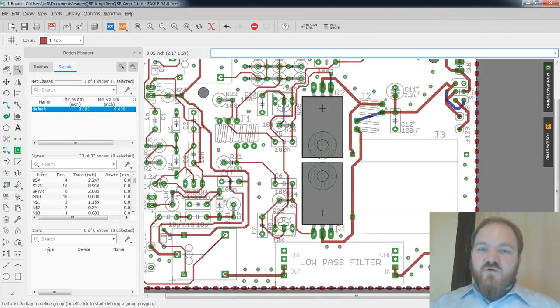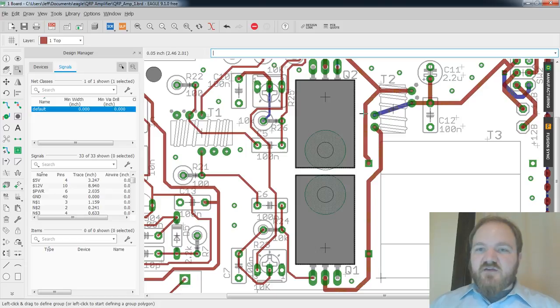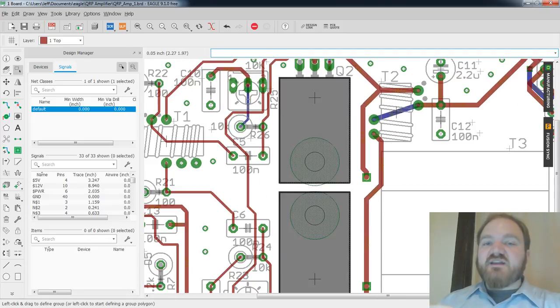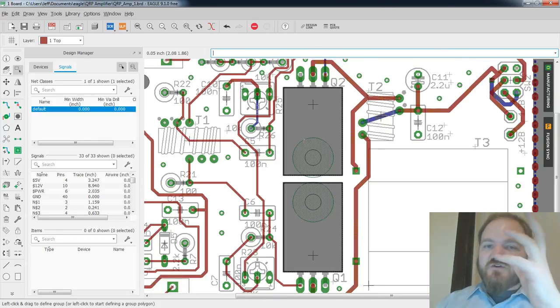Yeah, so what I did is basically add a rectangle on the board outline layer that sort of defines that hole and define it as a keep out. I did define it on a copper layer too, so please don't pour any copper in here so I'm not accidentally cutting through a ground plane. And that seems to have happened.